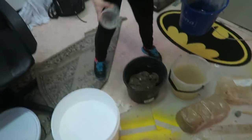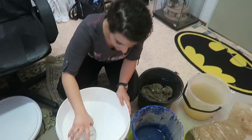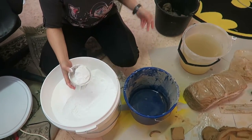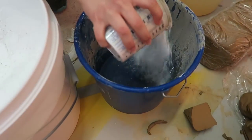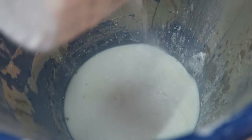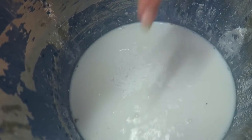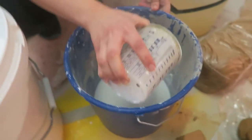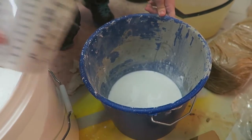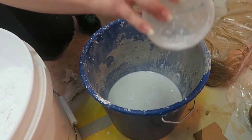What you're going to do is take a little bit of water and your plaster, and you're not going to mix it yet. You're only going to put it into the water until you see islands — until you see this. This is good. And after that, you're going to mix it. According to the video we just watched, if you didn't make enough, just make more.